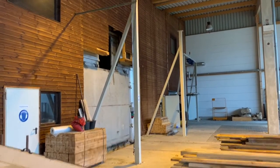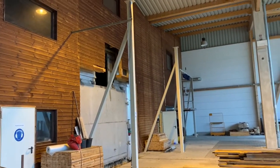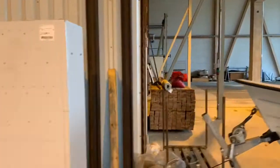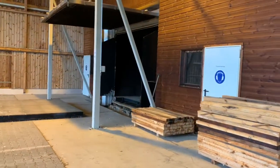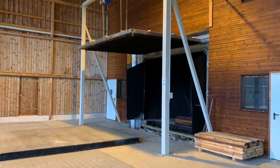This is the German facility near Berlin with a 60 cubic meter kiln and a smaller 8 cubic meter baby kiln side by side. The main kiln taking 60 cubic meters of wood per load is a flow-through system, so it has doors on both sides, minimizing the time needed for unloading and loading the kiln. One bundle is ready when the other one is rolling out.